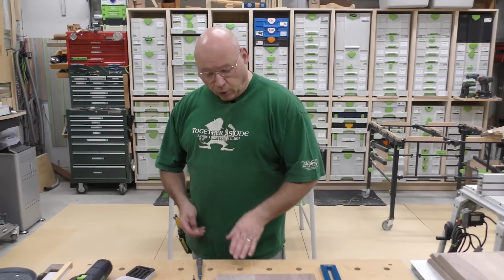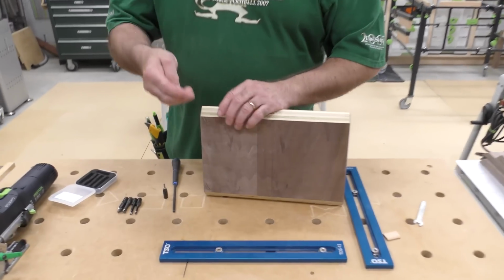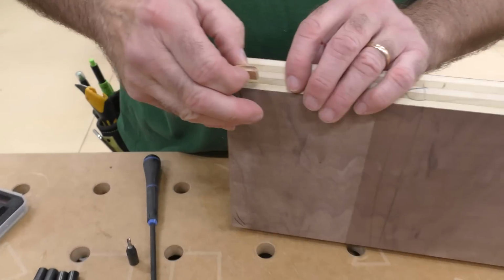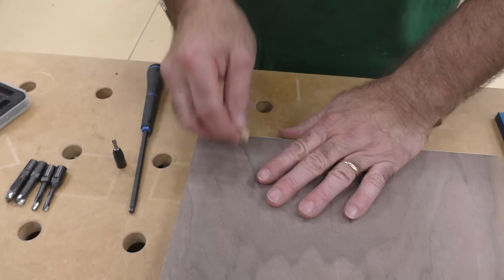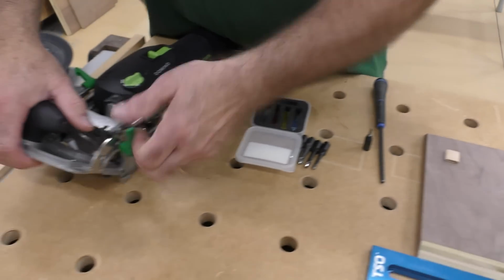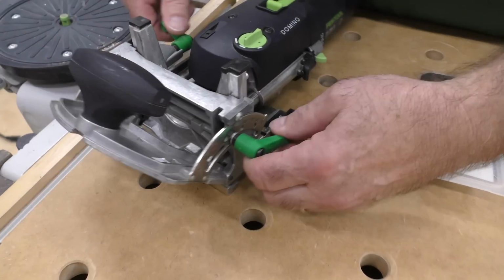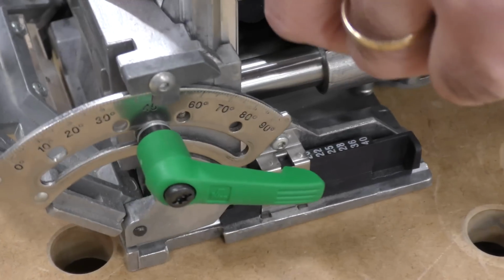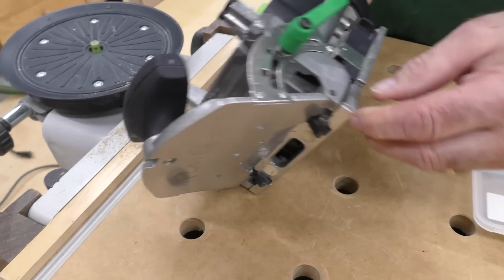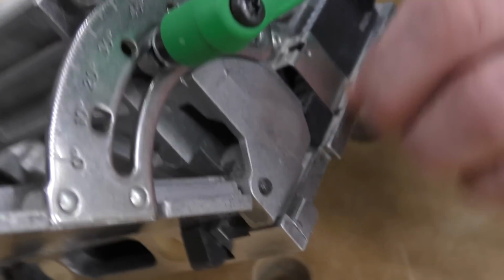Okay, so remember, we're going to work at the top of the bevel here. We want to place our 4x20 right here so we don't have blow through. So what we'll do is we set the bevel first, it's 45, and then we take this gauge block and take it all the way out. So our height of our plate and angle of our plate is set. You can see where that touches the metal right there.